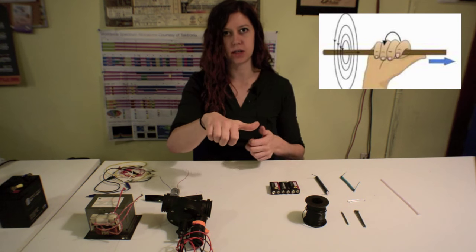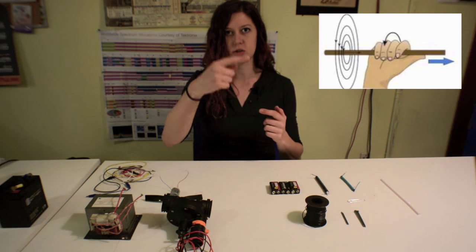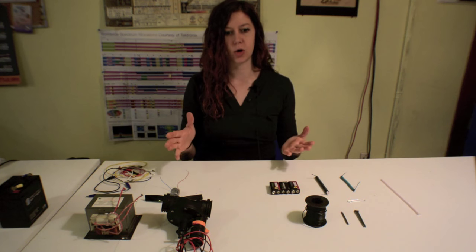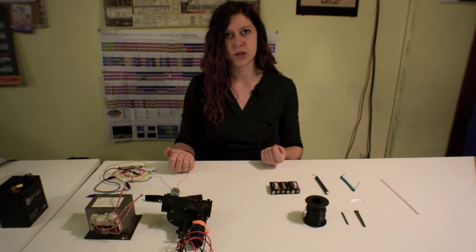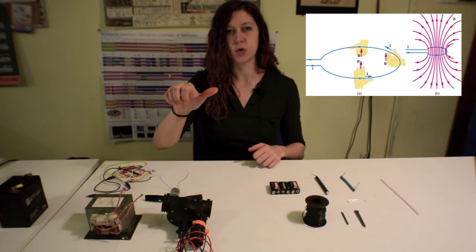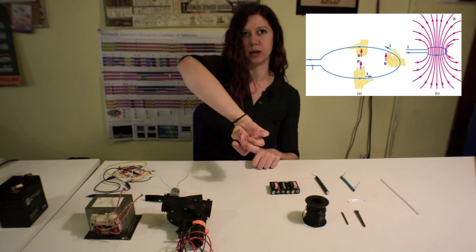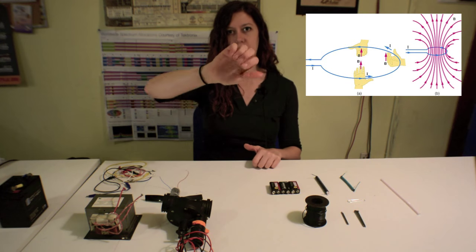In the case of a straight wire carrying a current in this direction, you get the magnetic field lines in circles parallel to each other, running all the way down the wire. We can use that to help us figure out how to design an electromagnet. For example, if you have a circle with current running through it, you can trace the path with your thumb, and what you'll notice is that all the magnetic field lines as they go around the circle — they sum in the middle.